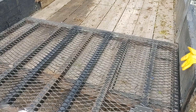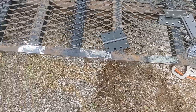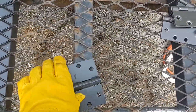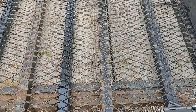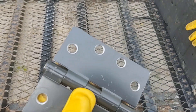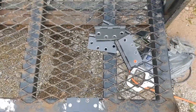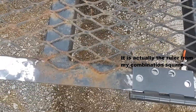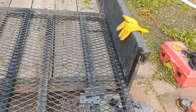Just to catch everybody up: I've cleaned the spots for the five hinges over here — you can see all five of them. Normally a hinge is mounted with a taper up in the corner, but I've flipped them over because I'm mounting them on the gate this way. I drilled the holes out and put a little tape on that side. I'm going to space them out using my speed square so I get an even spacing and don't have to worry about the hinge rubbing, then weld them in position.